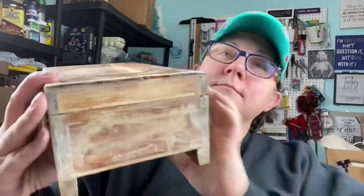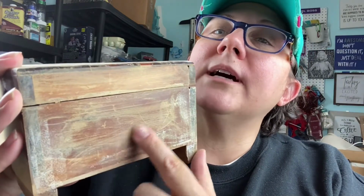Well, definitely an uneven weight distribution as far as sanding goes. So if you rock it, the sander is only sanding towards the back. The tip itself leaves these tracks. When I tried just the tip, so like if you were to get into a detailed area and you needed to use the tip of the sander, this is what's happening. It's just scratching. It's like etching.